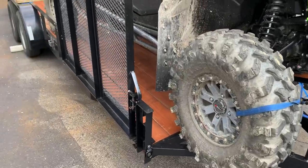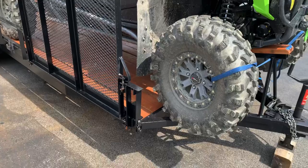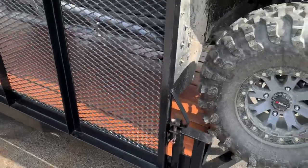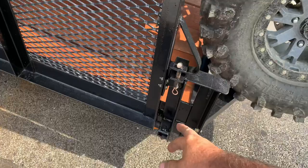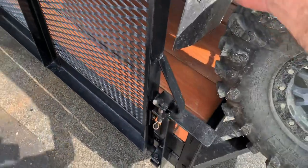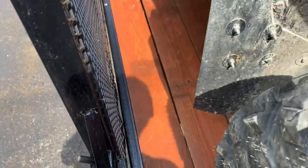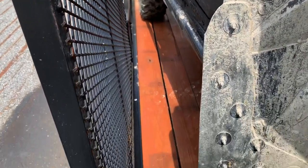This is putting two 4-seaters on a 20-footer. I made a 20-footer convertible utility trailer. And this thing was all rickety. So I put brackets in here, bolted it solid to the frame, and I bought C-channel right here. 20-foot pieces. I put one on each side. Goes all the way back, welded solid to the frame.